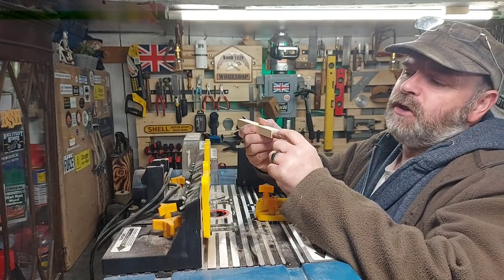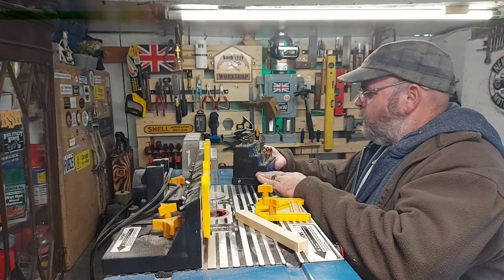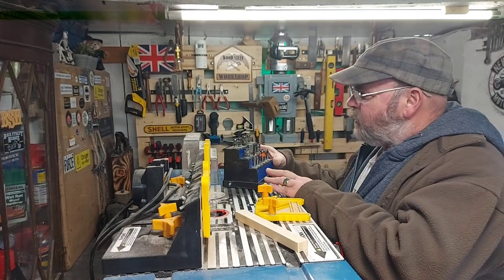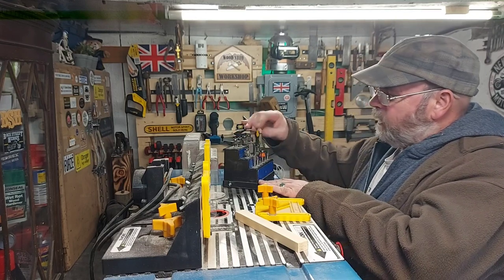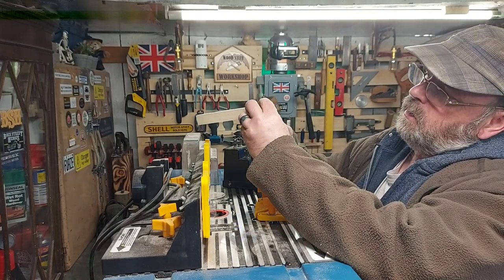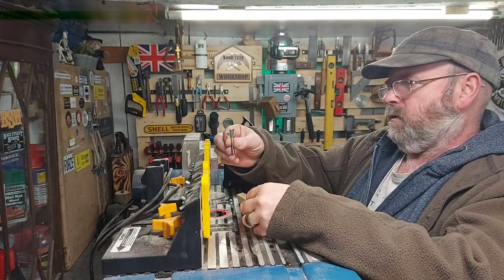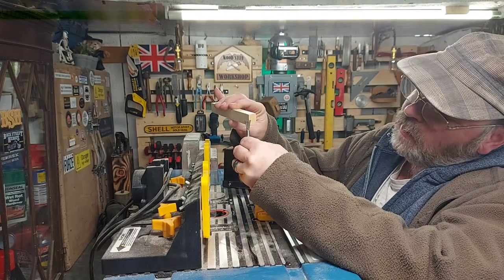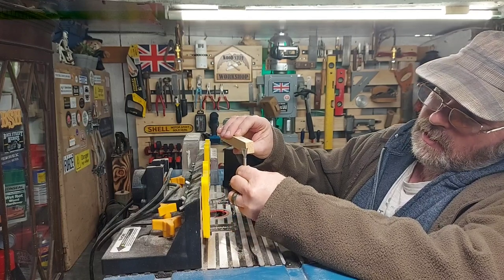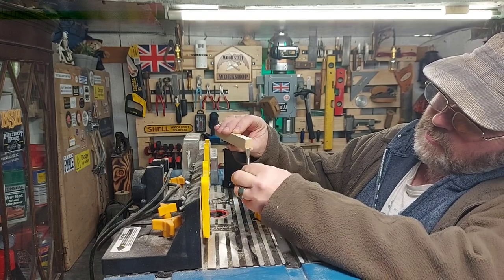Find a cutter to put a bit of a curve in there, but it looks like I haven't got a cutter to do that, which is unbelievable, because I've got some cutters here and some cutters down there, and I thought I'd have had something like it, but never mind. I think what I might try is that I'll put a dovetail cutter in and then run this through halfway like that. So I'll run it through there, and that'll be taking out a piece going into the middle.